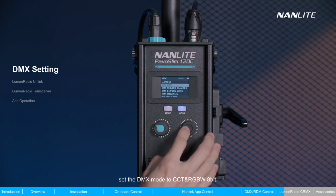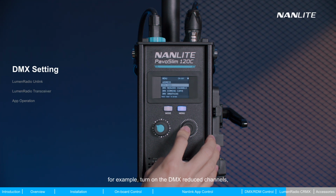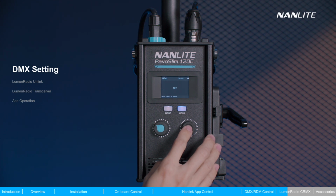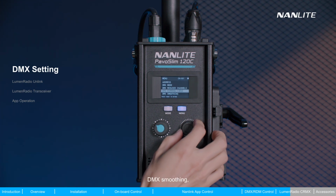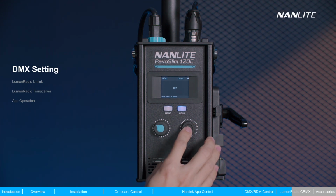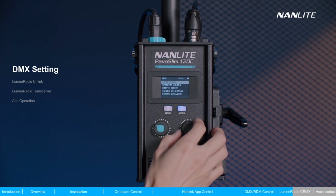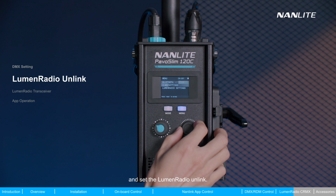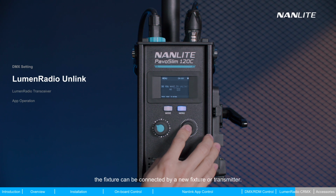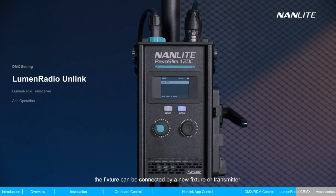Set the DMX mode to CCT and RGBW 8-bit. For example, turn on the DMX reduced channels. Set the DMX dimming curve, DMX smoothing, and set the LumenRadio unlink. After unlink, the fixture can be connected by a new fixture or transmitter.